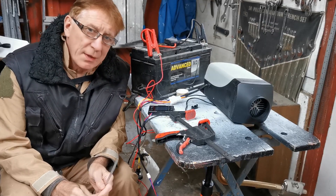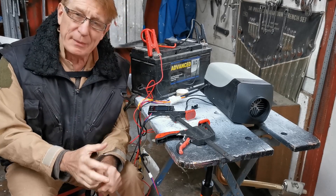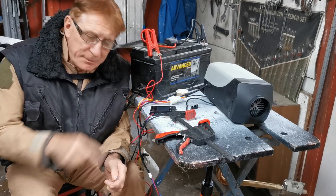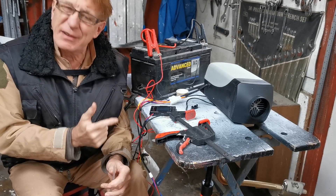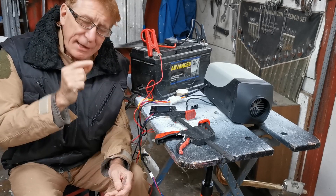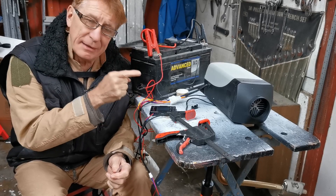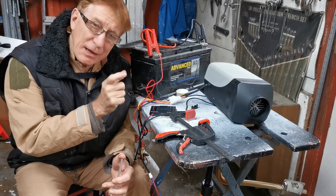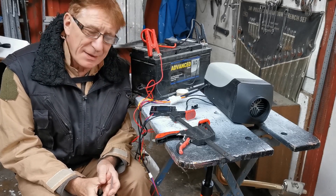I'm going to show you the priming function, but I'm not a massive fan of priming. This is for newbies who have just bought a bit of kit for the first time. If your kit's up and running, you don't need to prime — there'll be plenty of juice in the pipe, just press the go button and it will eventually fire up. If you've got a decent battery and not too long a run, you never need to prime even from the first time. Just keep pressing that go button — you are hitting your battery because the glow plug's coming up — but eventually it'll fire up. If you do use the priming function, make sure you stop it before the juice gets up to the bottom of the heater. Once it gets there, turn priming off, because if you get too much juice in the burn chamber without the glow plug already hot, you'll get a flood and all that horrible white smoke.